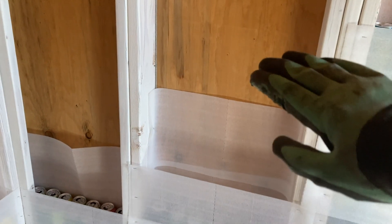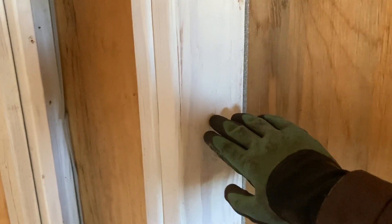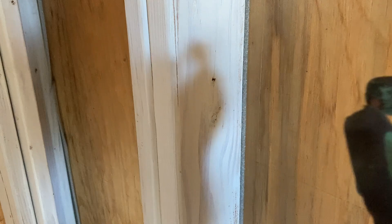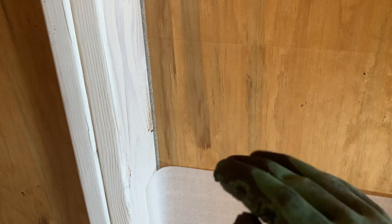It's quite simple actually. We've got 5/8ths plywood right here. In between that plywood and the studs, we've got this polyethylene foam that's 1/16th of an inch, R1, so the package says. R value is additive, so every little bit we can add to the assembly counts. Then we have more of this foam going across the plywood, stapled to the studs, so we're not penetrating through our sheathing. This is kind of like cheat's continuous insulation — not truly continuous, but pretty close.